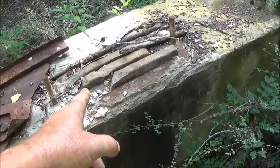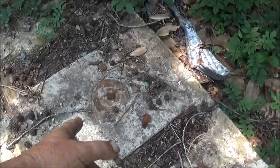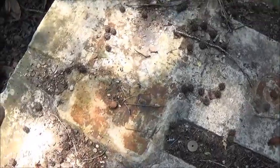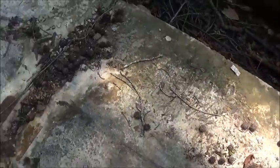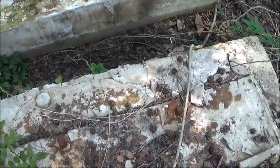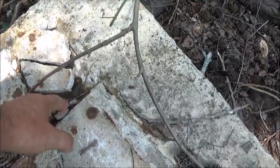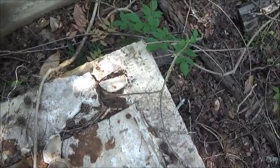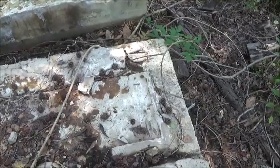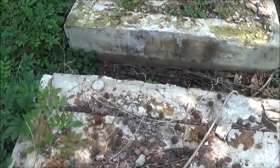It should be center to center at five foot six wide also — sort of a standard. There's my post from my oiler on the end, and I can see they grouted it. It looks like they put grout everywhere to the level and set everything in. This whole piece is grouted in, and everything is above the base. So we may just put an inch or so of grout and then set it down — that's looking like how they did it.